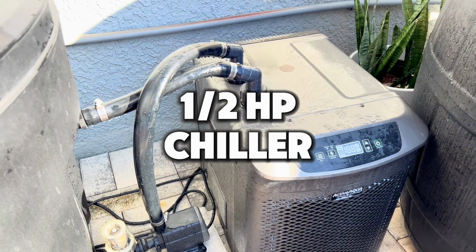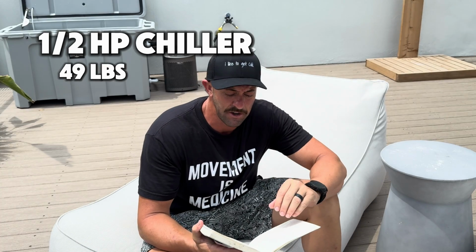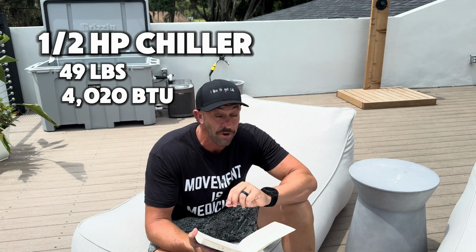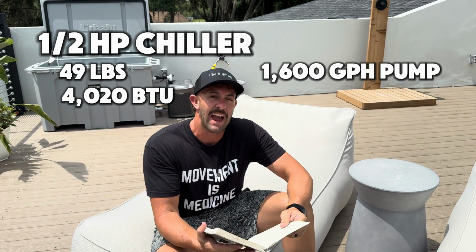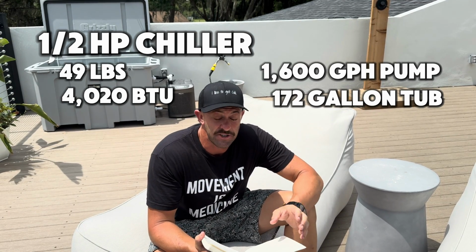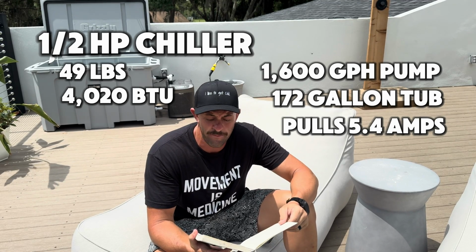But now let's say you really want to step it up and go to the 1/2 horsepower chiller because you live in a super hot environment and you're just afraid of having too weak of a chiller, and you're okay spending a couple $100 more. The 1/2 horsepower Active Aqua chiller weighs 49 pounds, so it's not much heavier than the 1/4 horsepower. It's rated for 4,020 BTUs, so 1,000 more. It can use up to a 1,600 gallon per hour pump, 172 gallon reservoir of water, and it only pulls 1 amp more at 5.4 amps.